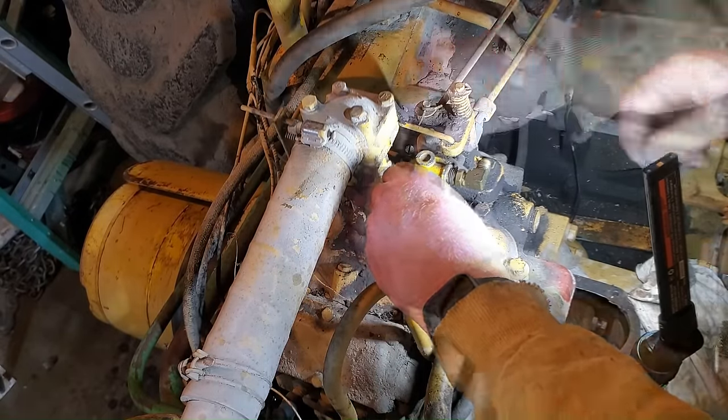Well, it's good and bad. Okay, the problem is this gear right here that turns over the big engine is always spinning. And I don't think that it should be. I think it should only be spinning when I pull back on the lever to engage the starter. So every time I get the pony motor running, and I pull back on the compression release and then pull back on the starter, since this gear is spinning at however many RPMs the transmission output spins, you're throwing this gear that's moving 100 miles an hour into this stationary flywheel. So that's the issue, and that is a problem that I'm gonna have to fix another day.